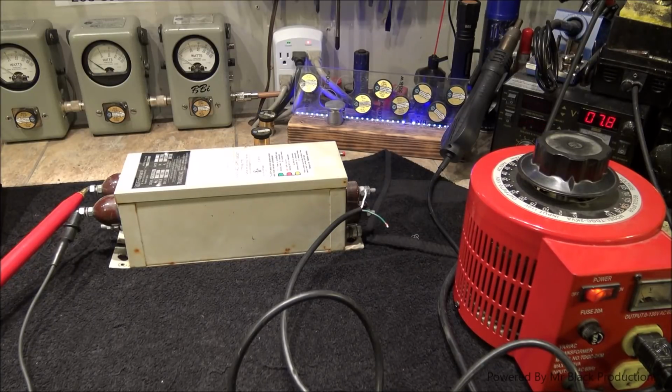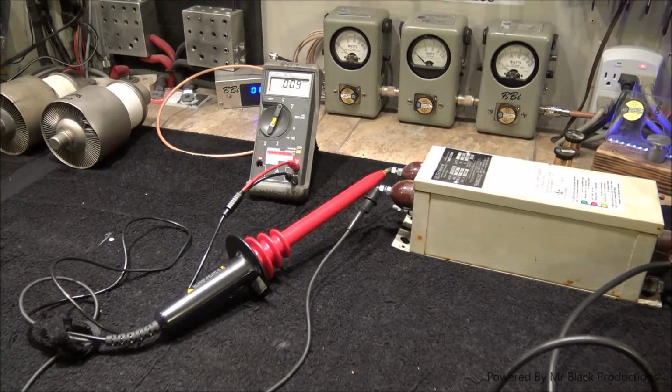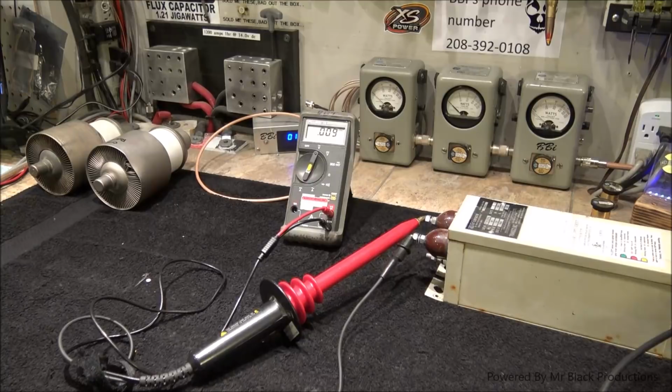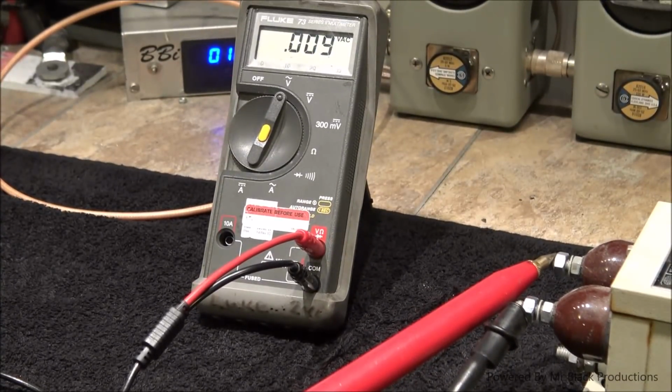So, on our primary side, we're going to vary our voltage from 0 to 110 volts. The output side of this thing varies quite a great deal. Now I wanted to show you guys how to read the meter, because we have a 10-to-1 reduction probe. This is an AC/DC probe, and it's rated up to 40K. I would never put this near 40K, actually, having worked with stuff higher than 40K. That amount of plastic surface area, no.